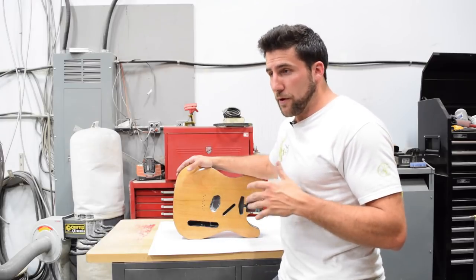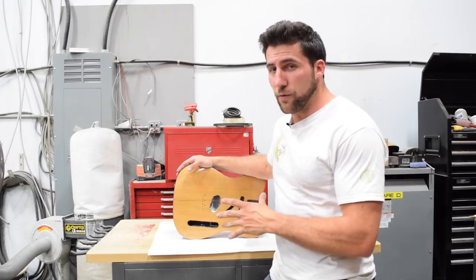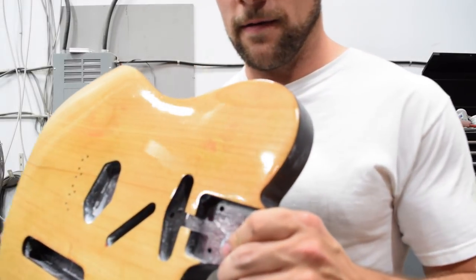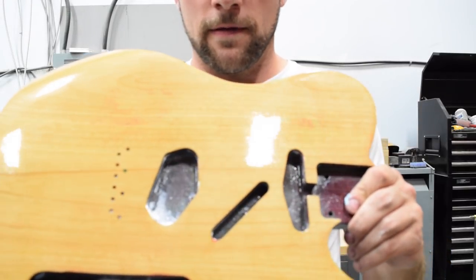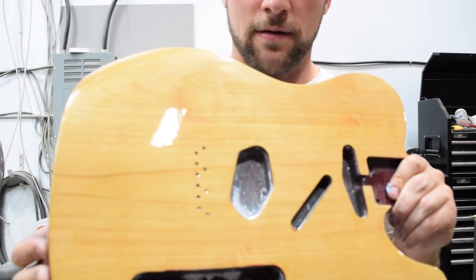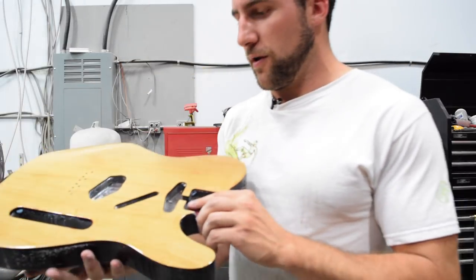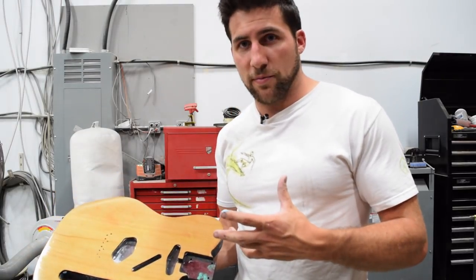If you're gonna really go into the full, careful sanding process, you probably want to put on a third coat. But even with just that quick little process, because this stuff goes on fairly thick, you've now seen that there are some imperfections in here, but you can get a pretty passable gloss. A beautiful gloss, in fact, just by brushing it on and then polishing it out. And if I had put on another coat and sanded it a little further, we could have made this absolutely perfect.